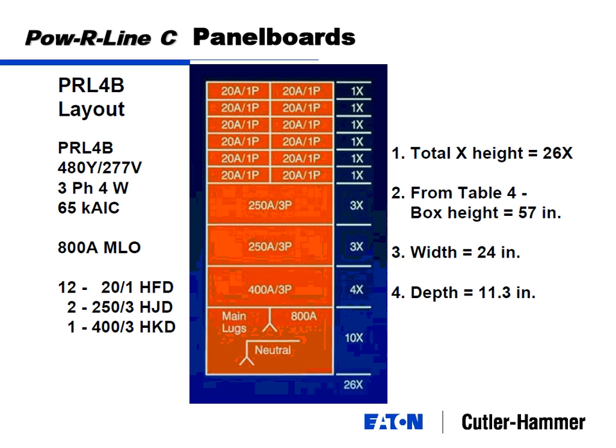And then, again, everything takes up space. The way the industry calls it is X space. You guys heard X space? In industry sizing terms, I think this actually started with Westinghouse. Everything is designated an X space. So one pole of a circuit breaker is an X space. And an X space, don't write this down, is 1 3/8 inch. But it makes it easier when I say this is 3X of space versus this is 4 7/8 inches.